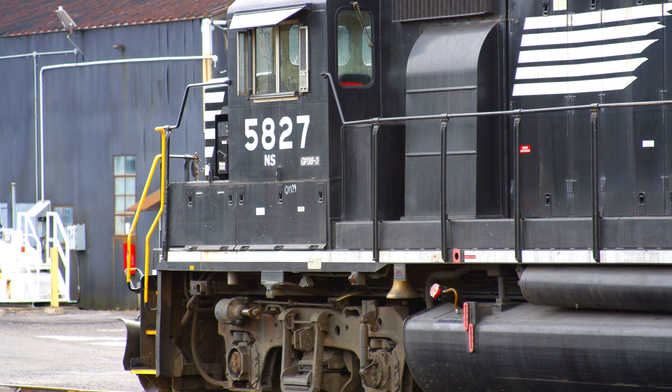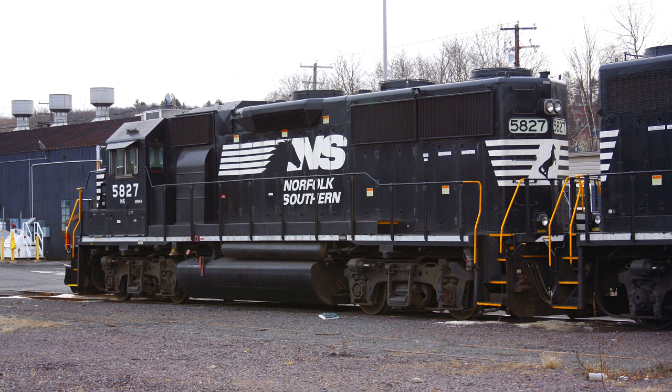SD40. From 2004 to 2007, Norfolk Southern rebuilt 37 former Southern Railway GP50 units into GP38-3s. The 3,500 horsepower 16-cylinder turbocharged 645F engine was derated to a 2,000 horsepower roots-blown 645E, which resulted in the removal of the middle radiator fan, the installation of a paper air filter box, and the replacement of the exhaust silencer with two exhaust stacks. Aside from these modifications, the original long hood of the GP50 was retained largely as is.